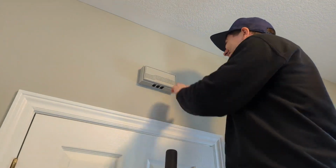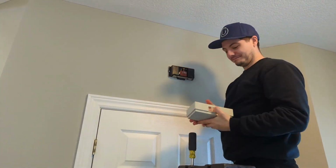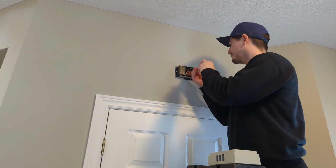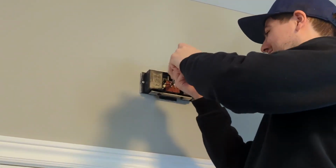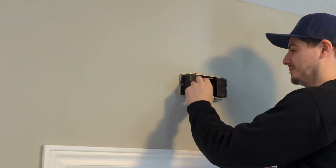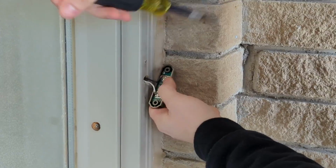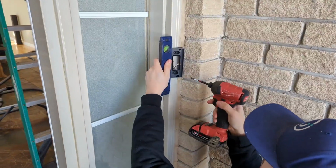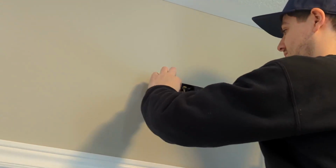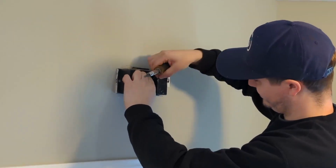All right, so Keaton's got his ladder here, and he's just going to get up on the ladder and unhook the power to the doorbell from the chime. It does relay from the electrical panel to there and then to the actual doorbell. So he's just going to deactivate that just so we have no power going onto the wires when we actually install the doorbell. Keaton's just going to pull that off. Riveting. So Keaton is installing a small little battery into the mechanical chime.